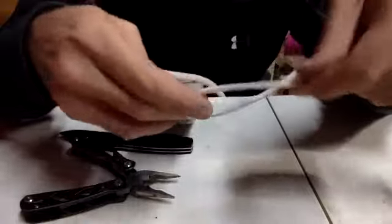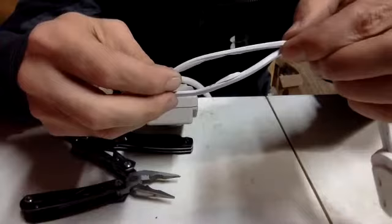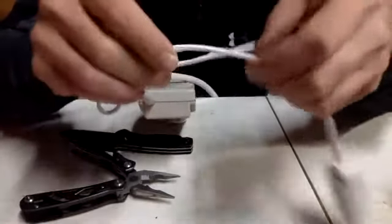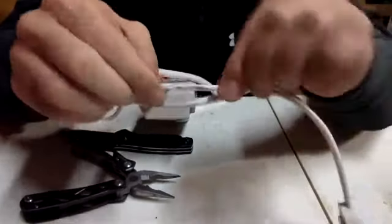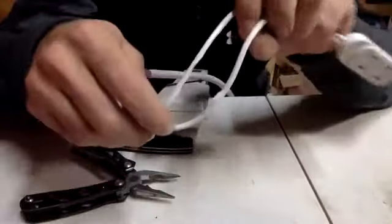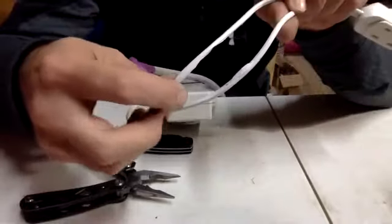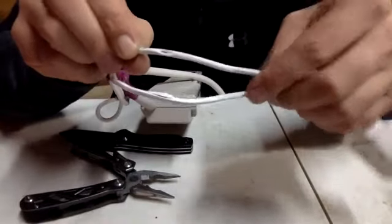All right? In this case, it's all right because it's right in the center. Okay? And I need to cut out a chunk. Yeah, this is on the hot wire. Okay? Remember I marked the hot wire with green? I need to cut out a chunk of this so I don't have any other wire that's exposed. I went and checked out this one. Okay? And there's no extra wire exposed here. I didn't tap into it on this side. I didn't tap into it over here. All right? It's just the green or the hot wire that I've got here.